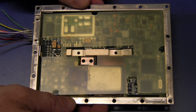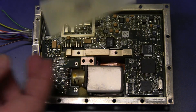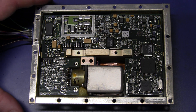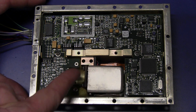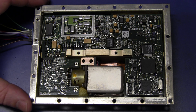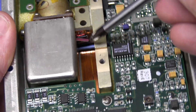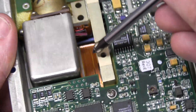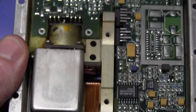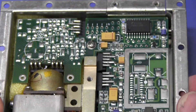Here's a first look inside. I took the bottom plate off — that was relatively easy. They've got a custom-cut Mylar sheet here, presumably to stop any shorts. And ta-da — there's your magic physics package. It's got a lot of other control circuitry as well. There's quite a bit in this thing. To connect to the physics package, there's a flat flex cable and a little flat flex board which takes all the signals back up to this part of the board. There's a fair bit of engineering which has gone into this thing.